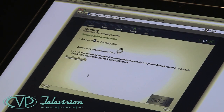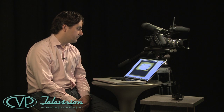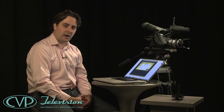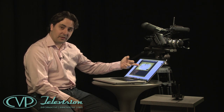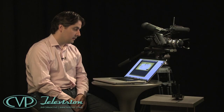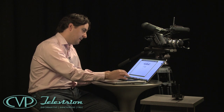It asks you to please wait while it updates the encoder and decoder settings to enable the streams. The fourth step shows the links to the streams so you can check them. Clicking Next brings you to a final summary window confirming you've completed the wizard — showing the wired/wireless network, the video input connection, wireless transmission, and a 3 megabits per second bitrate. Click Finish, which returns to the logout window. Log back in with admin/admin and all your settings are applied.